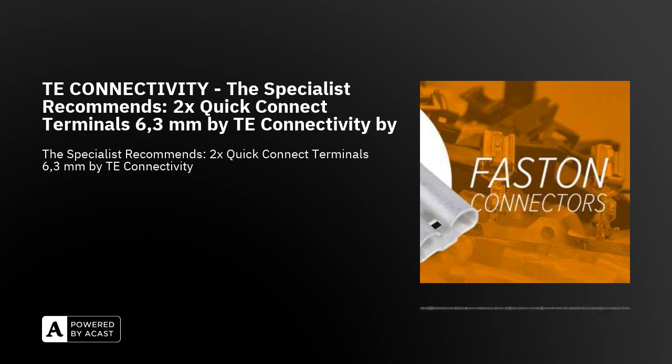The second option is a cost-effective quick connect terminal for mass production. For mass deployment in production, we often need the most cost-effective solution possible. In such cases, the uninsulated quick connect terminal can serve us very reliably. The key parameters of this connector are the same as the previously mentioned versions. The only difference is that although this quick connect terminal is also detachable, it is not as comfortable to detach as in the first case. All accessories for quick connect terminal can be found on our website.